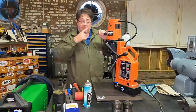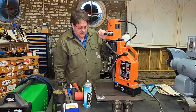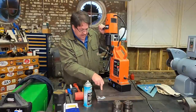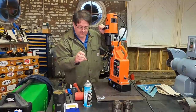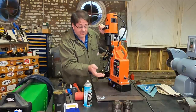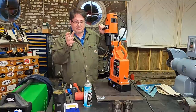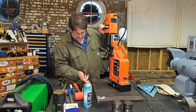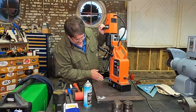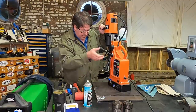I'll go ahead and spend a couple minutes to get the power in place and get this set up to go. I've got my power run, I've got my plate sitting here. You'll notice it's sitting on another plate. You've got to have a certain amount of mass of metal for the magnet to detect for it to kick the motor on, and that amount is typically three-eighths, which I have two layers of here. I've hung this one layer slightly off the table so the drill won't hit the table, and the top's 11-gauge steel too, so we're ready to go. I'm lined up on my first hole.